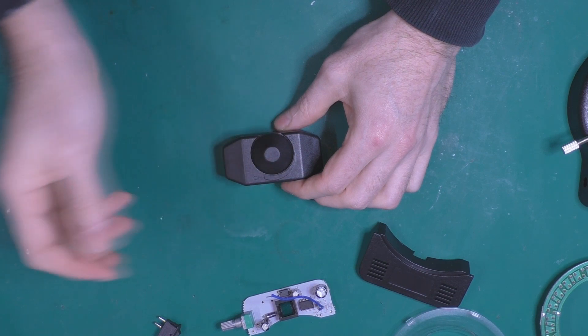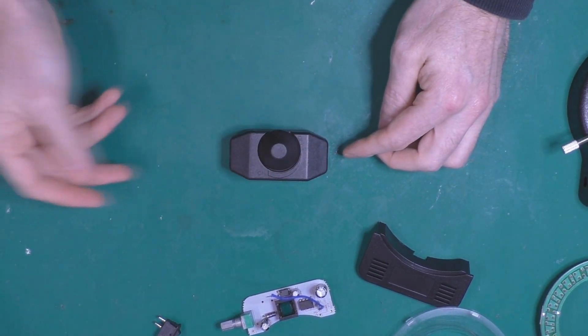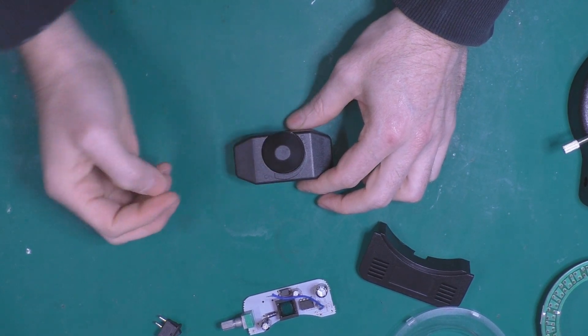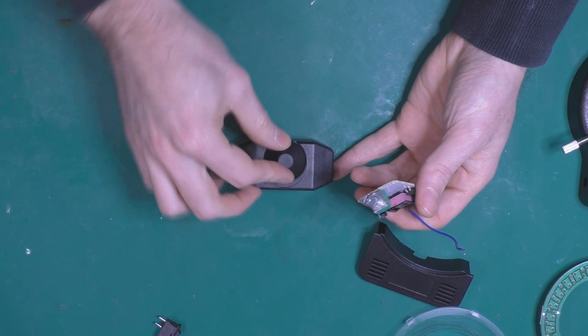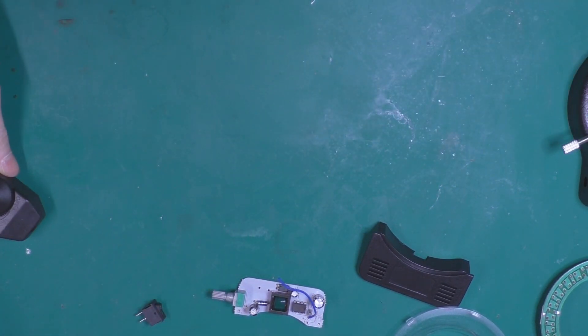This adapter is essentially for LED strips — you get an in and an out, and you change the brightness using this variator, which is a potentiometer with an on/off switch. So you turn it on and then adjust the brightness of the light.